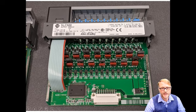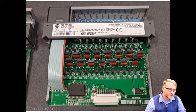You can imagine if we had a static electricity hit out here, it would come in and it might destroy this transistor, but it's not going to jump this bridge because it's an optical bridge, right? There is no direct electrical connection between these two. So again, what happened, you get a static charge. It might take out the transistor or one of these diodes. It might even take out the photocoupler, but chances are it won't bridge and it won't come here and destroy the sensitive logic, which means that while you may lose one I/O connection, you won't lose all of them, and you won't lose the microprocessor.